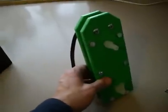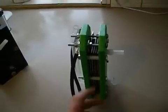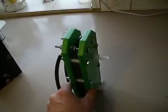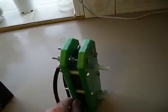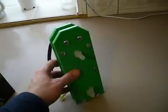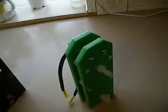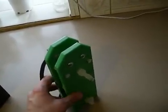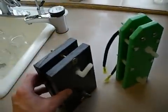Then I tried this — this is the Mini Green Machine. It's a five plate hydrogen generator: one positive, three neutrals, one negative. The plates are roughly 7 inches by 2 and a half inches. At 20 amps, this put out just under 1 and a half liters a minute — it was 1.45. Each time that I tested it, it was 1.45. So much better production than the little one that I built.